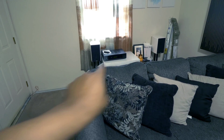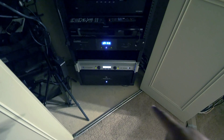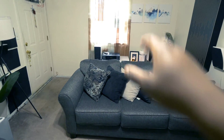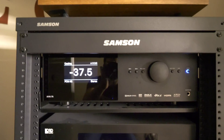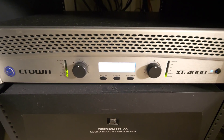I talked to them on the phone a little bit and ended up with this beast — this monster. Dayton Ultimax dual 15s on each side, wired at 8 ohms. They are dual 2-ohm speakers wired in series-parallel, running into my Crown XTi 4000. Each driver is 800 watts RMS, so 1,600 watts total for that subwoofer. I'm giving it 2,000 watts RMS, so each driver is getting about a thousand watts, maybe more. Crown amplifiers are underrated, so I'm getting close to 1,200 watts per speaker.